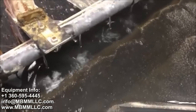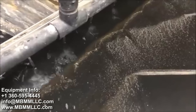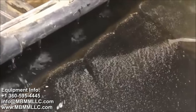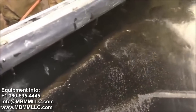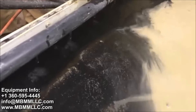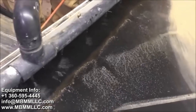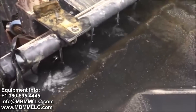We've stopped the table. Here's our gold line right under the water bar. You see that silvery material — that's actually steel out of the ball mill. The gold line follows all the way up to the top groove. Most of the gold comes out of the top groove. There is some that comes out of the second long groove. And then when the magnetic steel is out, it ends up being a nice clean line of gold right there.